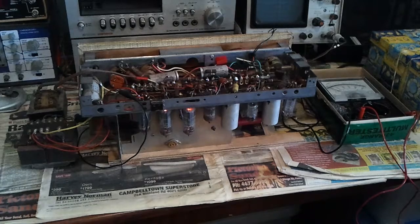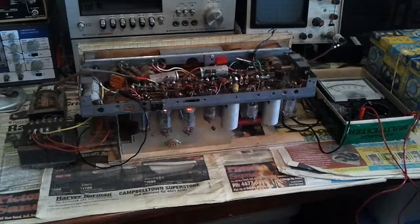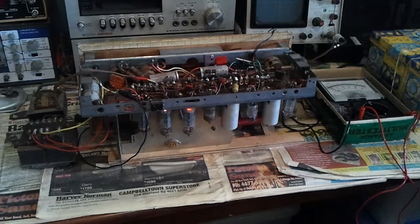This is the electronics from a Kriesler 1961 model 1188 stereo, and it was given to me in the late 90s. It had had the power transformer removed and also the selector switch, which would normally go from the turntable to the radio. That also did some high tension switching. So there were a lot of wires in this section of the radio cut.